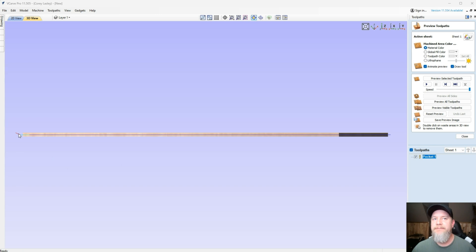I'm going to do a raster pass with a plunge and calculate that. This is basically going to do a straight line cut right across the piece of wood wherever I place the X and Y position. I don't actually need the entire piece on the machine — I can just place the CNC right where I want it to cut the line and let it go. We'll generate our g-code and go back to the CNC machine.